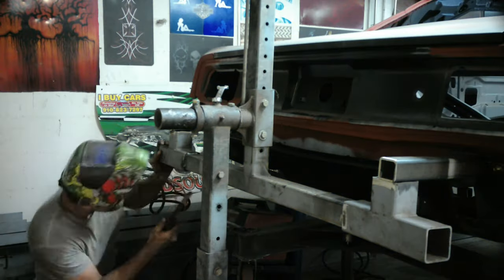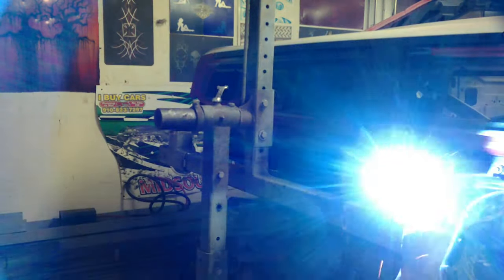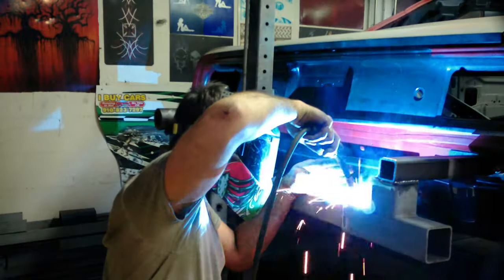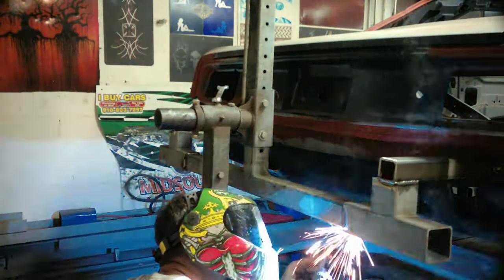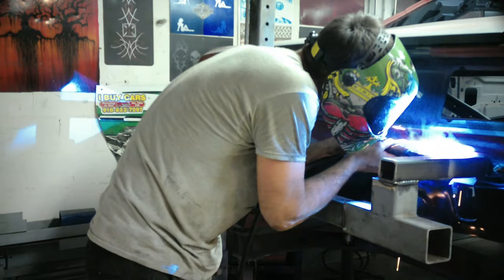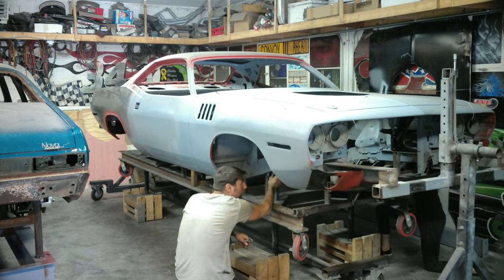With the rotisserie level we don't want anything fighting each other, so a couple fine-tuned adjustments, then we take out the MIG welder and burn them in. I welded most of the sides — the brackets that slid on the edges I like doing that way because I can still adjust the rotisserie mount slightly. When I cut these brackets off, I can cut them off those T-brackets and slide them off, making it easier when changing out mounts. The two-and-a-half by two-and-a-half is solid welded; the T-brackets get three tacks each.